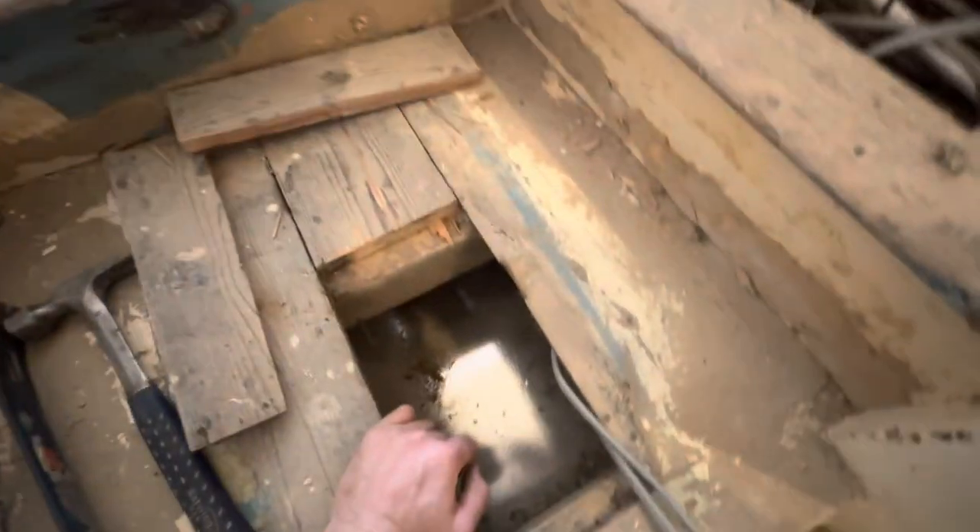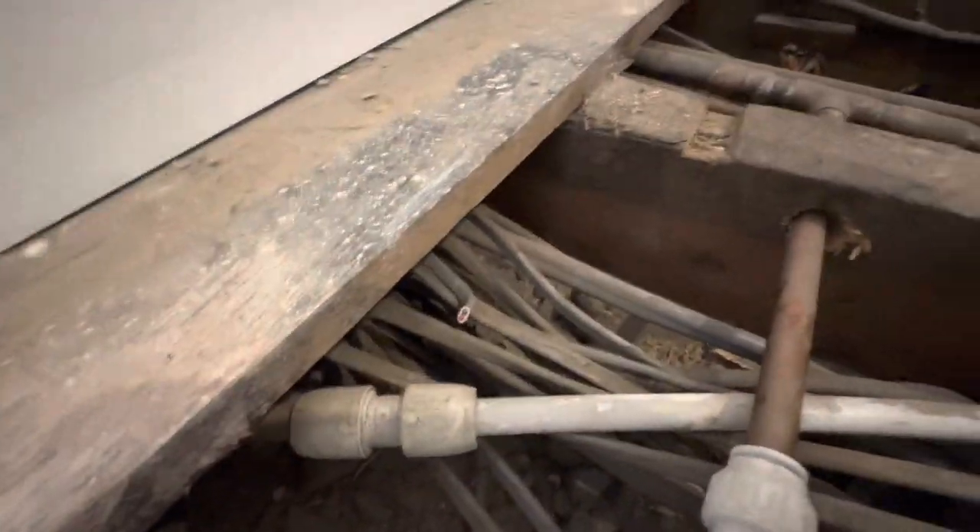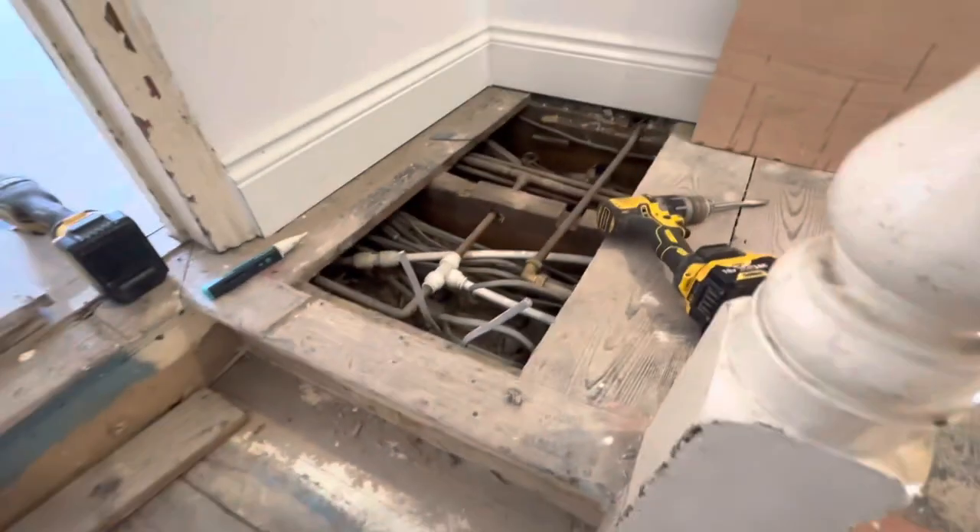I'm going to get the fused spur wired in. There is a lot of old cable just left in here — old cable from the time before, by the looks of it. So this one is a bit of a call-out. It was given to me at the end of last week to replace another job that we can't get back into yet, where they've had the floors all downstairs covered in 100mm concrete. They've had to dig out the floors, fill it with concrete, and we're waiting for that to cure, then it needs to be polished. So I can't get back in there yet because I've got to put the lighting circuit in and also cut some chases for the downstairs ring. I'm going to nip off and get some Wago boxes so I can break into this kitchen ring final circuit and put a spur in for the Saniflo.